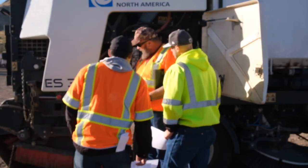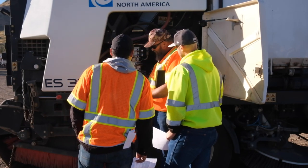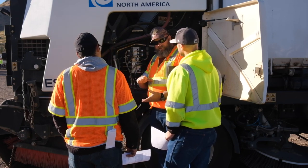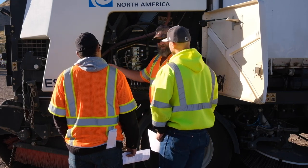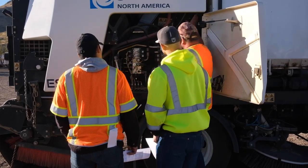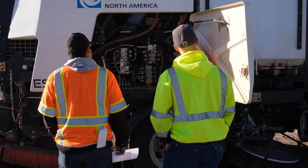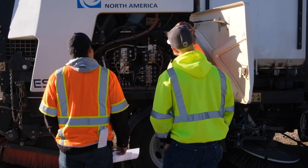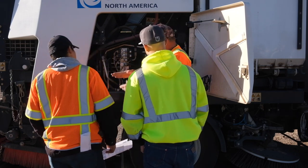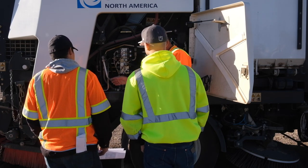There's a cleaning point. When I clean this thing out, I'm actually going to wash it twice. If you look right down the side here, there's a pan — you're going to see where it's starting to build up dirt on it. That's a dirt trap that will build up fast. In a day, I can get three to four inches of dirt down the side there. I have to clean that out every night. If you don't, when you raise this hopper up, that elevator is stuck inside the hopper. Before the hopper will go up, this elevator has got to come back — this ram drags it back. And what happens is that plate slides up underneath those water tanks. If they build up too much dirt, they can't slide back.